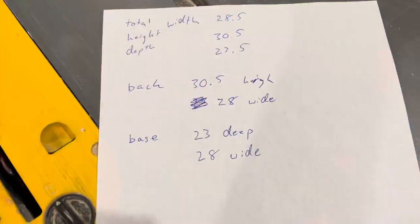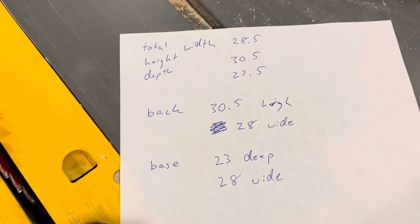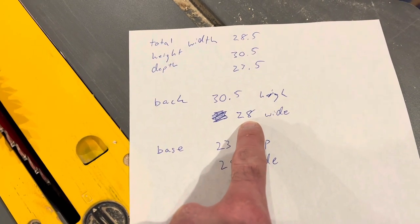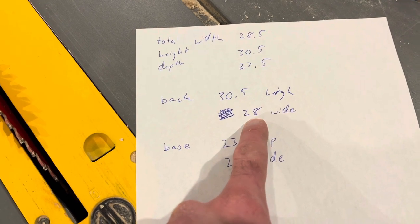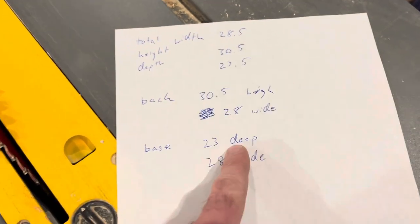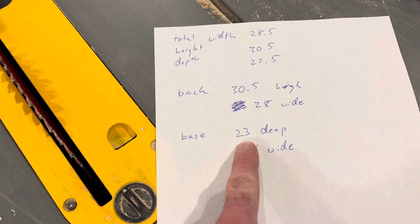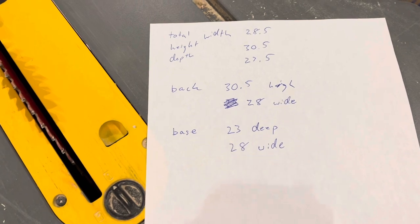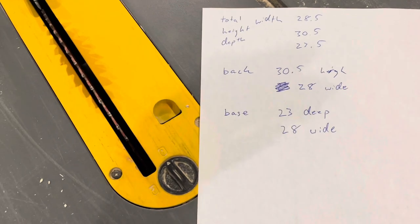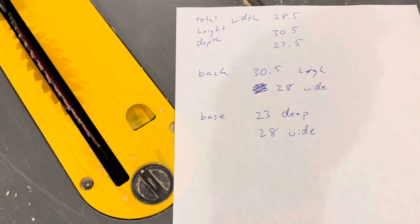While the CNC is running we're going to produce the back piece and the base piece. These are the dimensions of the cabinet. The back piece is going to be the same height — we subtract off the dado distance, the depth. It's a quarter inch on each side, so this is a half inch less than the total width of the cabinet. The base is 23 by 28 wide — 23 deep — because we don't have a dado on our back piece, so it's a half inch less because we're using half inch walls in the back. On the side it's a half inch narrower because of the dados and the outside walls.